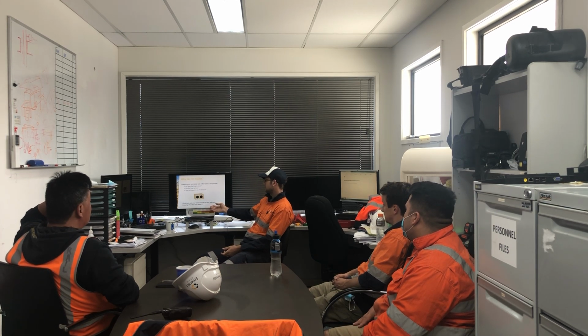You two are pretty new, so you're probably not quite aware of some of the equipment or machines we have here. So ask simple questions: how does it work? Tell me how it works, then I can be sure it's safe. Like I said, would you put your hands inside the box without knowing what the risks are? No. So you want to make sure there's nothing in there that could hurt you before you start the work. That's why we isolate things.